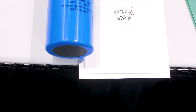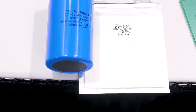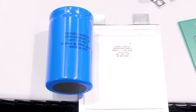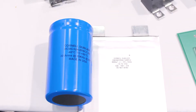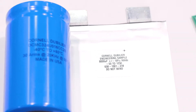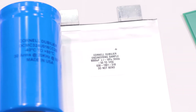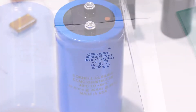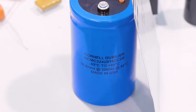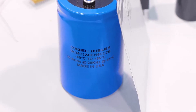Well, it's really in the packaging. Here we have a polymer capacitor in a flat pouch. There are several layers of aluminum polymer material encased in this sealed pouch, and the seal is excellent. We get tremendous long life out of it and it doesn't lose any capacitance over time. The properties remain very stable over time and the ripple current of this package is tremendous. This part handles 30 amps of ripple current, which is equivalent to the ripple current capability of this screw terminal capacitor.